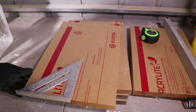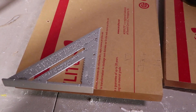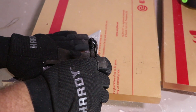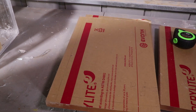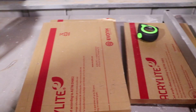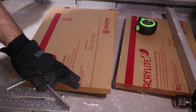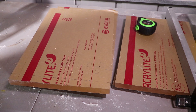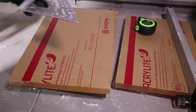I'm going to take this handy dandy square, set my pen on an inch and keep with it. There we go, that line works nicely. Let's get the other side and back side, then we're going to set our saw blade to half an inch depth and just start eating away at this. Hopefully this is going to work out - I didn't buy enough for a screw-up, which is kind of a mistake.